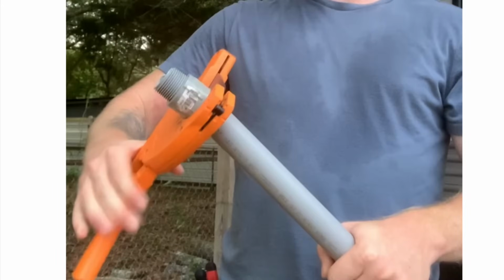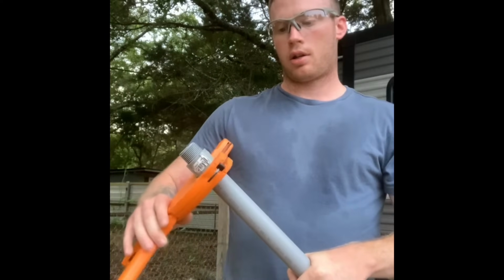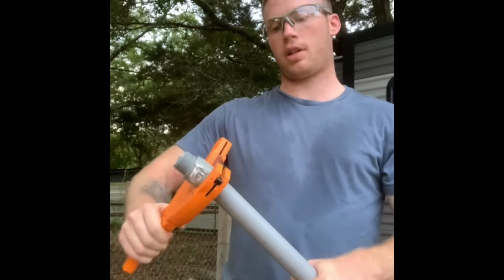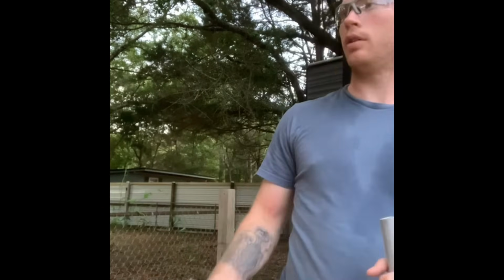Okay, I'm using a handful of tools to do this, and 2 of them I really want to point out to you that are awesome and that you should invest in if you're going to be doing electrical work: the PVC cutters that I have. You can see in this photo here are Klein PVC cutters. They cut up to 2-inch conduit and it cuts so easy. You don't have to wrench down on it with both hands like you do the cheap PVC cutters. You could do it with one hand, super easy, and it releases easy as well. You're not fighting them the whole time.